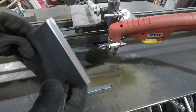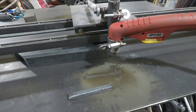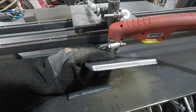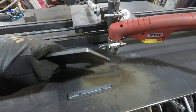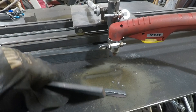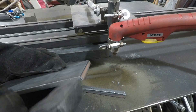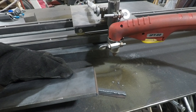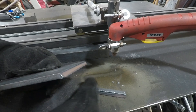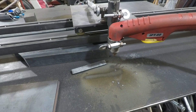I think playing around with the settings I'll be able to get some really nice cuts out of that. Let's see what happens if I knock this slag off. There we go — that came out pretty nicely, I'm pretty pleased with that. I'd love to hear any professionals' comments or suggestions on adjusting this. I honestly think I just didn't have enough air to blast straight through — my plasma was pretty straight, just didn't seem to have the air required. That's still a little too hot to handle even with welding gloves, but thank you very much. If you have any questions, let me know and I'll be happy to answer anything I can.